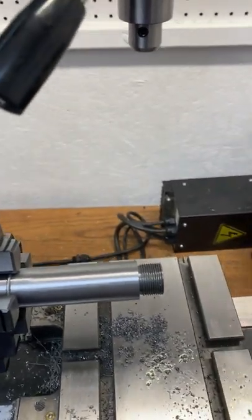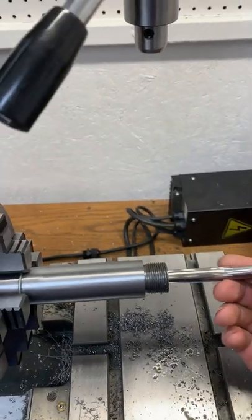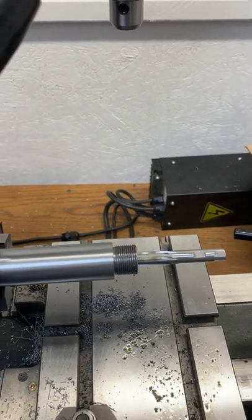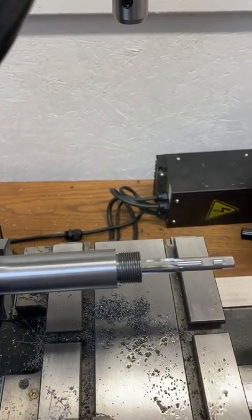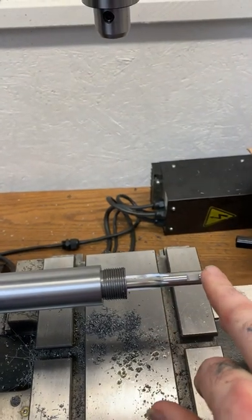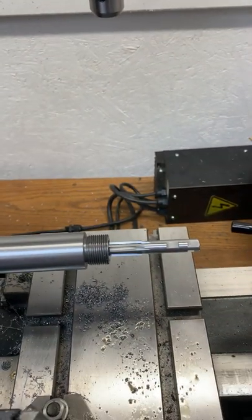I'll give you an idea what that is. This is a chamber reamer, but just for an example — it would be a precision ground rod that you'd put in your muzzle, not in the chamber. He was indicating right here and then there, and adjusting the chuck until he got it to a few tenths.